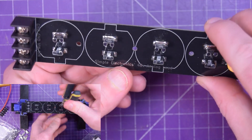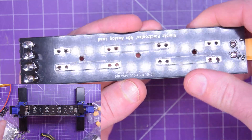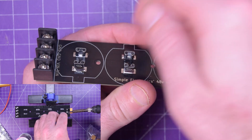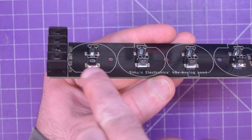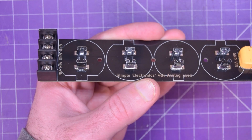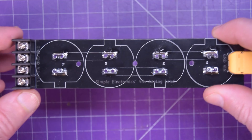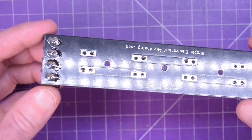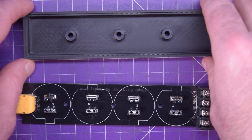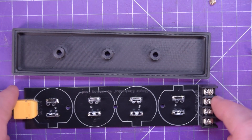Here's the finished product. A couple of tips: I just soldered directly onto the pad on the front side. You can solder from the back underneath, but if you flood these connections with solder, it'll wick right through and clog the little tabs — ask me how I know. So just put a little fillet on the back; these things fit in there so tightly it's never going to go anywhere, and it'll have a good connection. The XT60 connectors actually come in the default library for KiCad, so I didn't even have to make my own custom footprint. I also made a nice 3D printed case for this — the case files will be on my GitHub page.